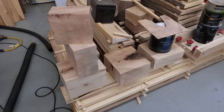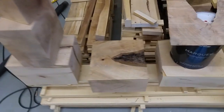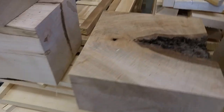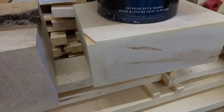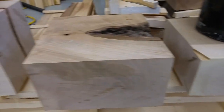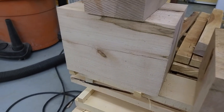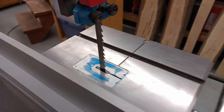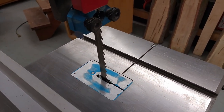These are some old blanks I've had sitting in the shed forever — everything from oak and maple — and if you look closely you can see they almost look like they've been planed. These are bandsaw cuts on all of them. It does a really nice job with the finish of the cuts after you get it set up, and that's with the Laguna three-quarter-inch Resaw King blade, which is not cheap but definitely worth it if you're going to do any re-sawing work.